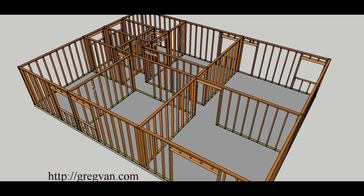This home is well-designed structurally because it provides a tie all the way through the building in both directions. You can see that if you had a strap here and a strap here, these walls would tie together — same thing with your ceiling joists or running a strap with some blocks to connect walls together. Then you really have a nice structurally sound building. But you can't remove all the walls all the time without affecting the strength of the building.